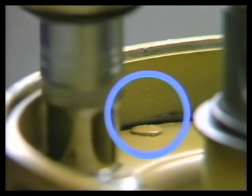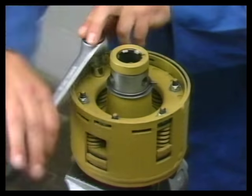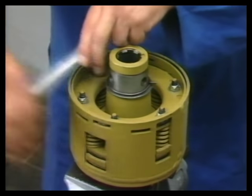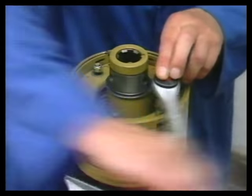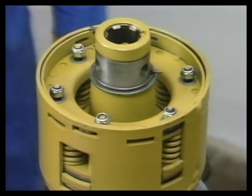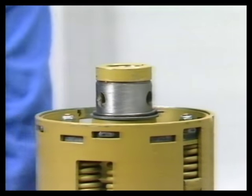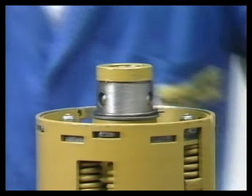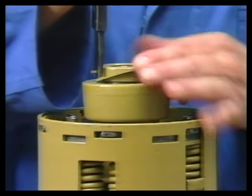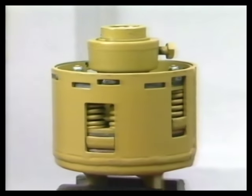When unfastening the spring nuts, make sure that the adjusting ring is positioned behind the securing cams of the springs. Fully release the springs and turn the nuts as far as the bolt end. After assembly of the QC lock, the friction coupling K96/4 is ready for use.